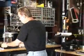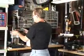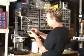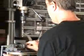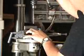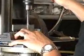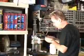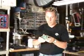Now we're going to drill out this lid right here using a regular drill press. I have a little vise — I put the lid in bottom up so this little part is facing up, that way it sits flat. Just stick it in there, start your press, and take your time going slowly so you get a nice clean drill. When you're done, you'll have a nice clean hole in there.